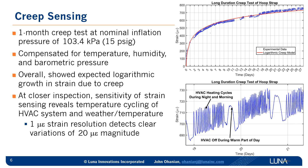When you take a step back, everything looks as it should be. If you zoom in on that signal, you find that it is extremely sensitive and was able to pick up the cycling of the HVAC system in the testing area. Each one of these oscillations is the HVAC system turning on and off to heat the space overnight and early in the morning. In the afternoon, the HVAC system turned off, and you can see the smooth shape of the temperature response of the inflatable. Because temperature affects pressure, that is the main coupling into this strain measurement. The one microstrain resolution of our strain sensors was able to clearly detect these variations, which were on a magnitude of about 20 microstrain.